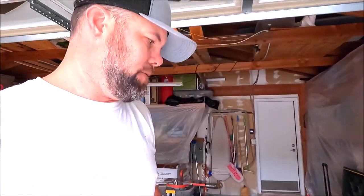Recommended snapper — makes the back wall and sidewalls go very quickly. We've already snapped the tile; it snaps very clean. We can also snap all the tiles on the left and right sides of the shower wall. Let's get to business and get this shower probably 80% complete today.